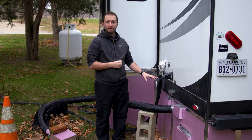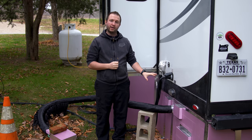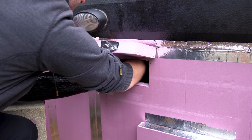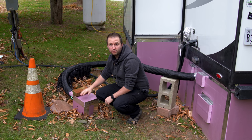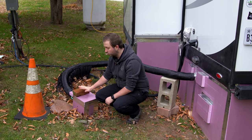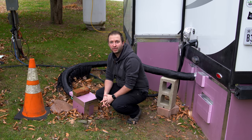We come out every few days, pull the valves, then close them back up — it only takes a few minutes. We left small flaps open in the skirting so I can reach in and pull the valve without removing the whole skirting. At the dump station end there's a clear elbow — we made a small cover from leftover foam board for extra protection, weighted down with a brick so we can easily remove it to check that everything's working correctly.